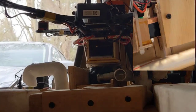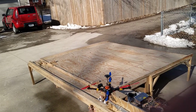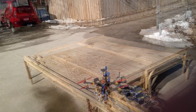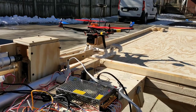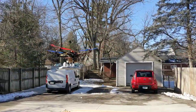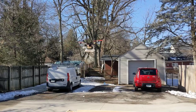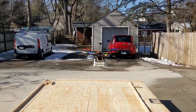Other solutions are out there for this problem of drone battery swapping — see the description for links. But they all suffer from one of three killer issues for the average Joe. One, they require precision landing — I've got wind and can't control it within less than a meter or so. Two, they're prohibitively expensive, think a giant robot arm with vision. Or three, they don't give any plans for how to build them.